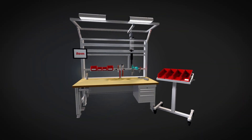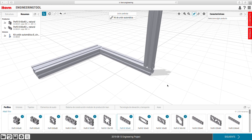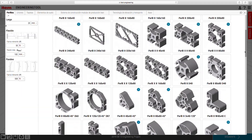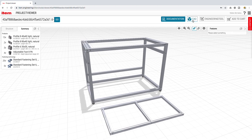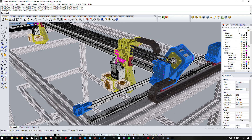A very special feature of Synerges is that they work with ITEM, a modular construction system focused on the industrial sector with which you could build virtually anything. This system comes with the ITEM Engineering Tool, an online design tool that allows you to configure a structure using the components of this construction system. Not all components are available yet since the tool is still in development, but the entire range of profiles is available. You can export the 3D model in almost every 3D file format to integrate the design with your favorite 3D modeling software. In my case, as I work with Rhino, I exported the structure in STEP format and imported it in Rhino, where I continue developing the design of the rest of the components of the build.